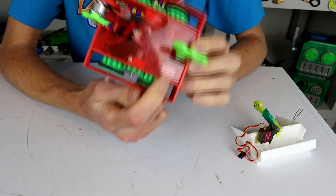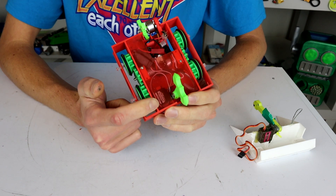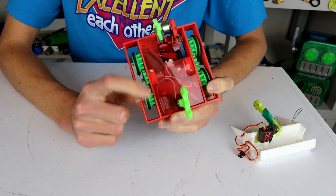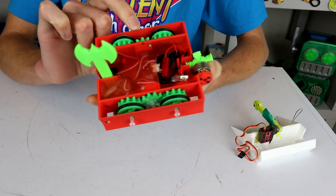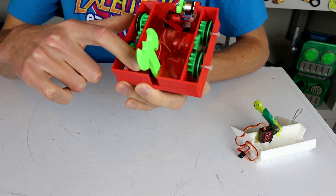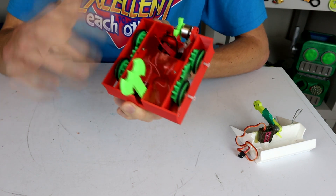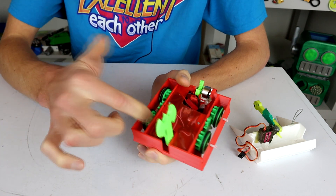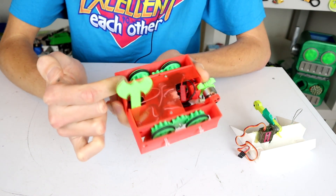We've got a tiny little high voltage servo which will do a much better job. It's also smaller and lightweight, which means I can put more weight into other things — and those other things are going to be gears. I've got a gear stack up here that I've 3D printed. So I'm going to try and use a smaller servo with a gear-driven axe so that the load of the weapon hitting something is taken up by a shaft and axle rather than by the servo and whatever the servo is being mounted to.